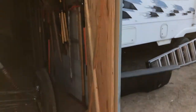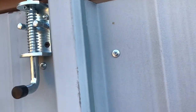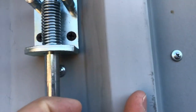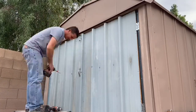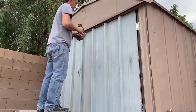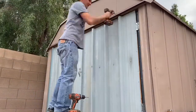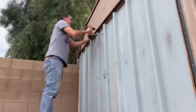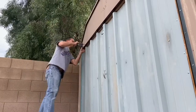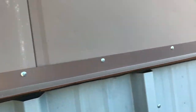Once I put those 1x3s on the back side and attached the metal roofing to the front side, there's practically no warpage left in the board. I overlapped the corrugation of the metal roofing so the outer door holds the inner door tight all the way down. Once I got those anchored, I realized because of the corrugation I might get water inside the shed. So I found this little L-shaped sheet metal in the rain gutter section at Lowe's and anchored that so if it does rain, the water goes on the outside of that corrugation instead of the inside.